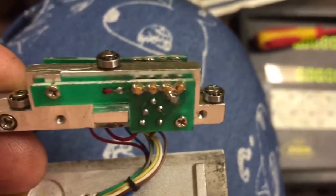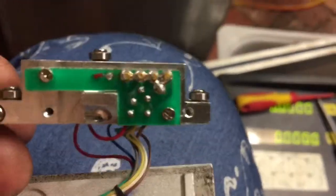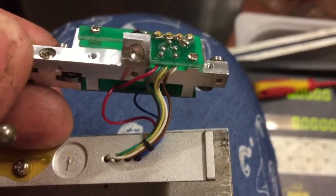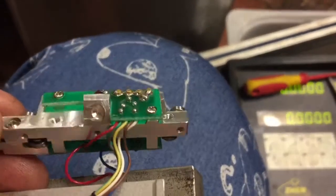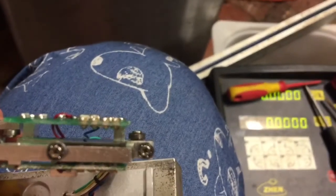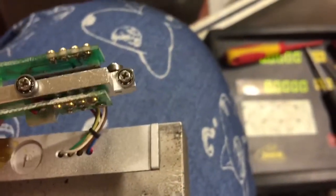On the other side we've got four receivers. Again we've got a V-plus fed to one side and then off to the other end we've got at various positions across the quadrature pick-out. So we've got green, grey, yellow, green, yellow, brown, and white — which is probably the low end sense of those readouts. I'm expecting the glass scale inside the assembly will be sliding along and as it masks and clears, these various sensors will get a pick up on quadrature relative and absolute positioning.